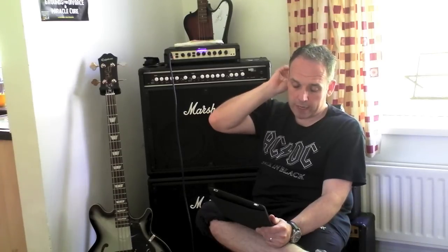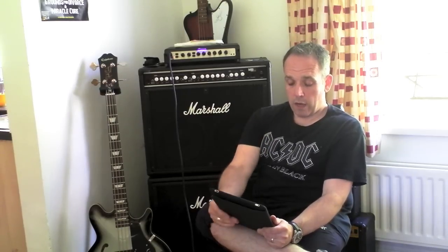The treble, I'll skip to the treble because the mid-range is a little bit more complicated. The treble, you're looking around the 4 kilohertz range, 4,000 hertz, and that's giving you a 15 dB boost or a 20 dB cut in the 4 kilohertz frequency range.